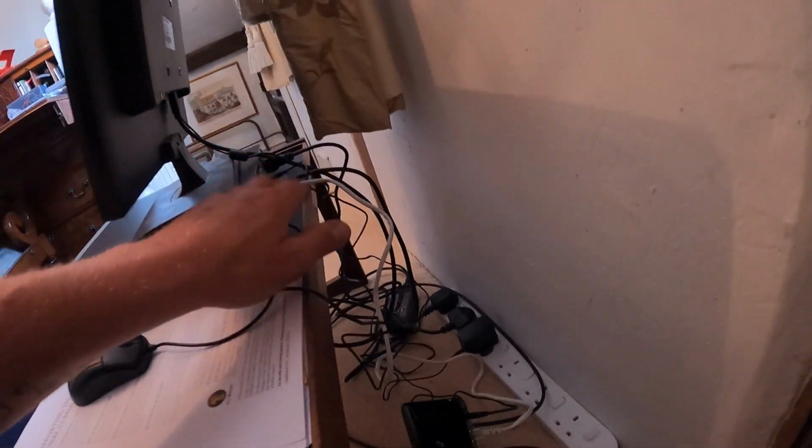cameras, got nine different cameras, essentially only coming into one cable, this white one that goes into the recorder, and you give the cameras IP addresses, so you can tell the recorder to go and look at these IP addresses, i.e. look at these cameras, and then display them and record the images. It's quite technical stuff. It's not the sort of stuff you'd attempt yourself, really.